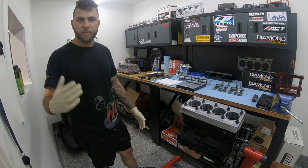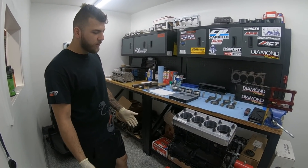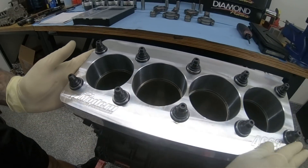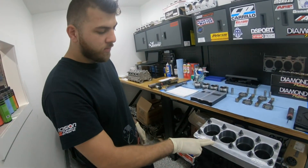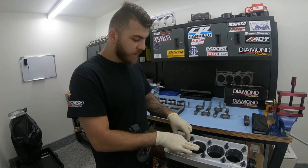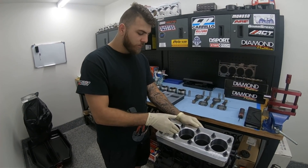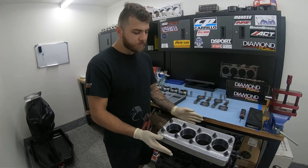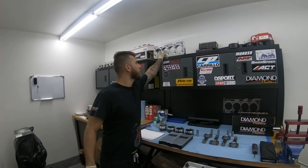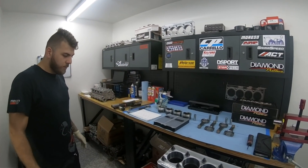So today, like Jeffrey mentioned, we're going to be talking about torque plates. This is something I've always talked about, even from the days of Josh's videos. A torque plate is essentially a block of aluminum plate that they machine to mimic a cylinder head being bolted onto a block. In this case, MAP — Modern Automotive Performance — makes this torque plate for the 4G63. The bores are big enough for a 4G64 as well — they're 87 millimeters — so even with a 20-over bore you can use this. We also have the 4B11 one here.